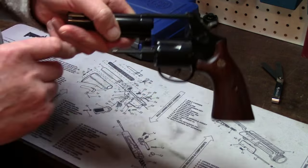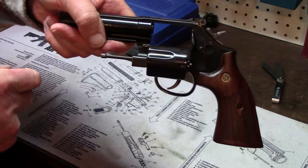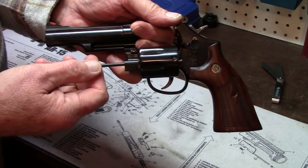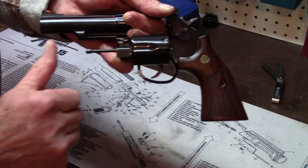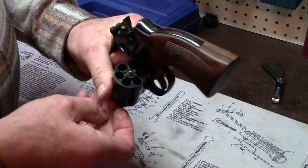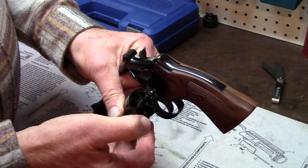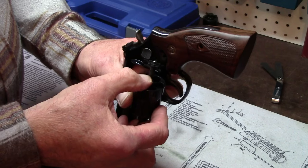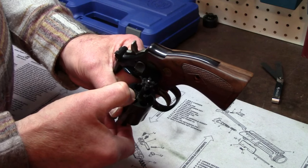You'll notice there's a difference here — there's a clasp, a detent right here, rather than being a plain flat surface. And right here, you no longer have that pesky issue with a two-piece center pin surrounded by an ejector rod. It's simply an ejector now. We also no longer have two pins underneath the ejector that can get wiped out, and there's no longer a fragile little track that ran up and down the ejector that could get wiped out or spin off and ruin the small keyway on the cylinder.